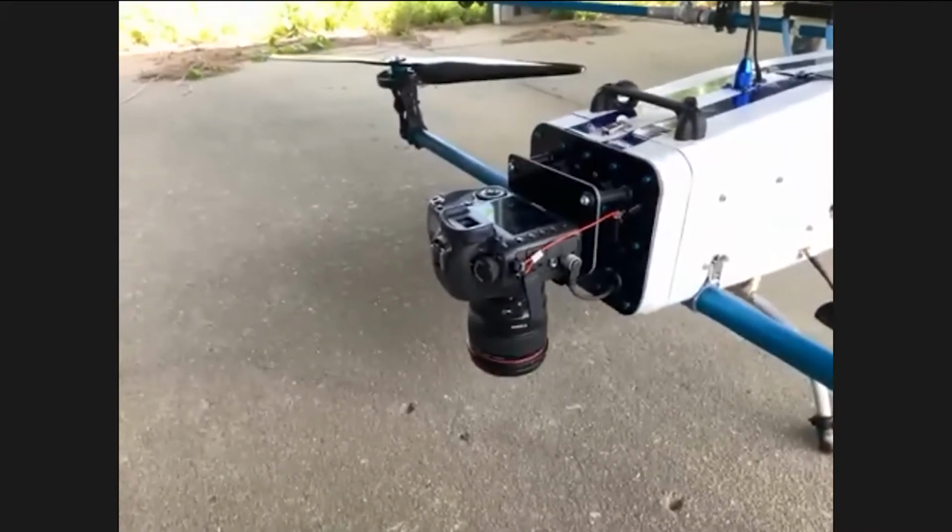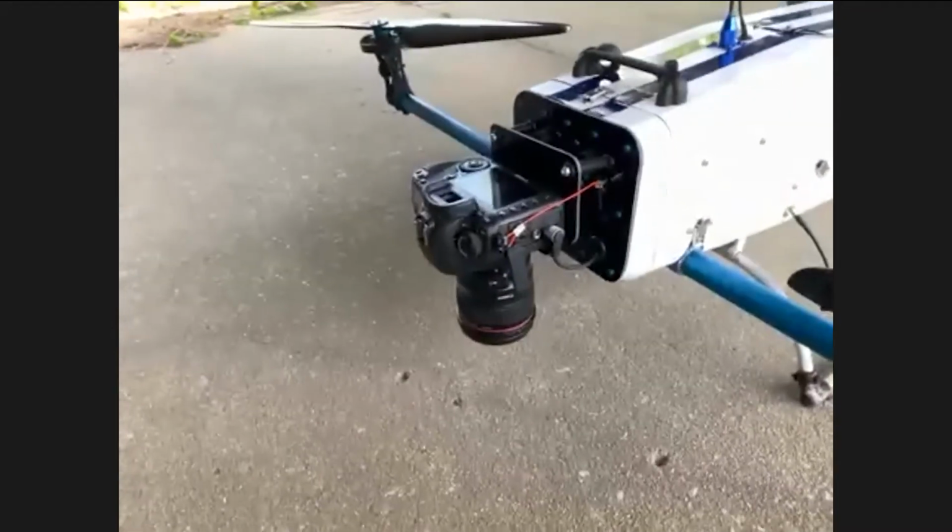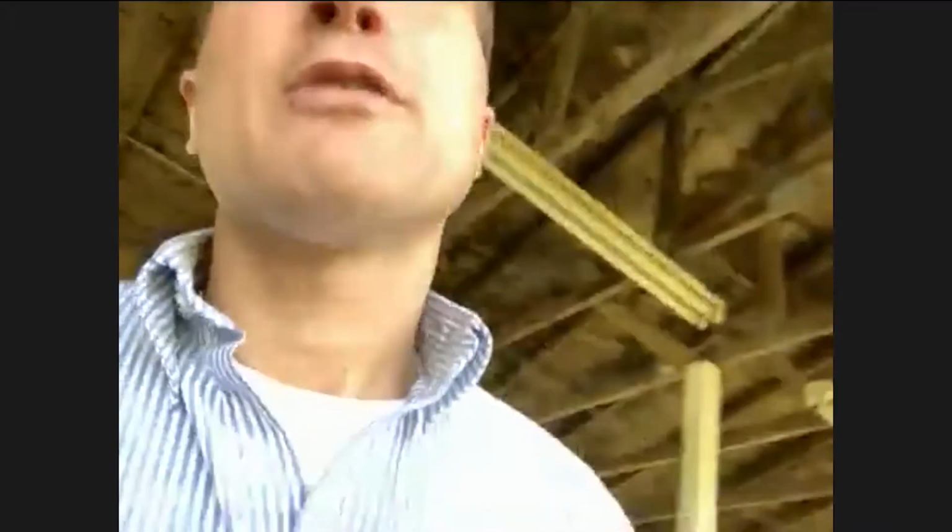What are the weather conditions that the drone can fly in? Let's first talk wind. The maximum wind gusts we have tested in is wind gusts to 34 knots, which is like 38 or 39 miles per hour, much higher than what most multi-rotors are safe to fly in. In the pilot's operating handbook, we've specified a limitation of wind gusts no more than 25 knots.